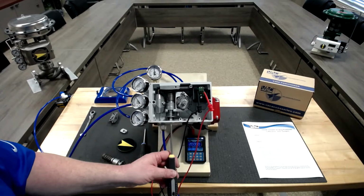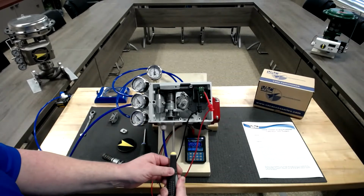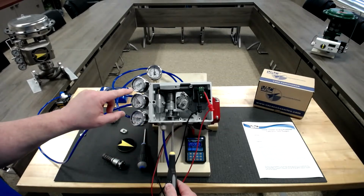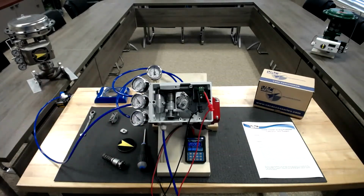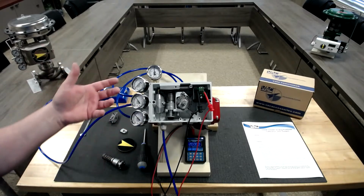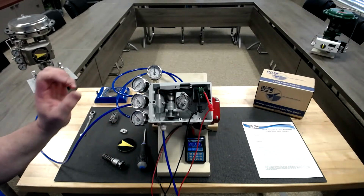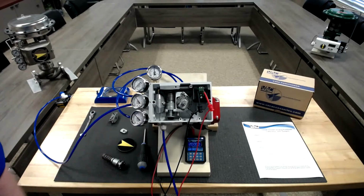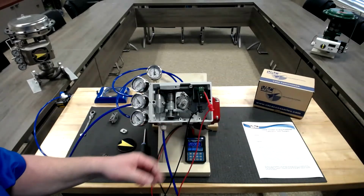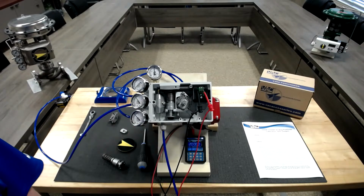And we will be adjusting the span. We'll adjust it until we see the gauge move, and then turn the opposite direction until we drift down to 0 in about 3 to 5 seconds. You can repeat the steps at 0 and span, going back and forth until you're happy with them. But the 0 and span have very little interaction. Generally, in my calibrations, I will calibrate the 0, calibrate the span, go back and double check 0, and that's generally all it really needs.